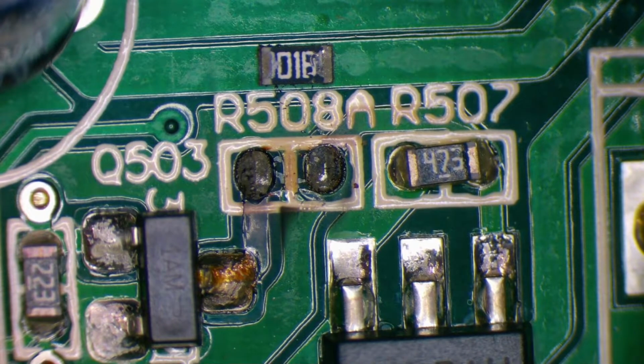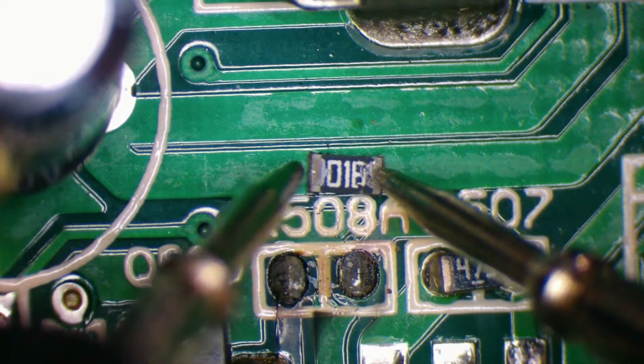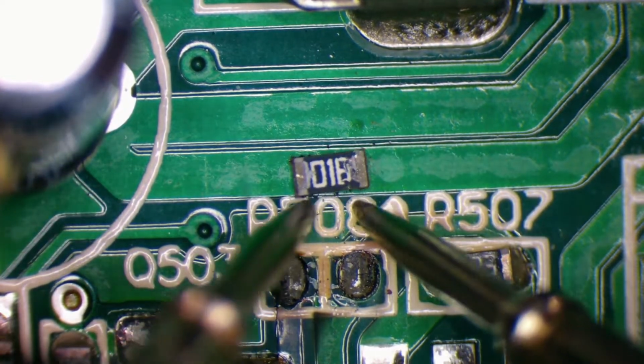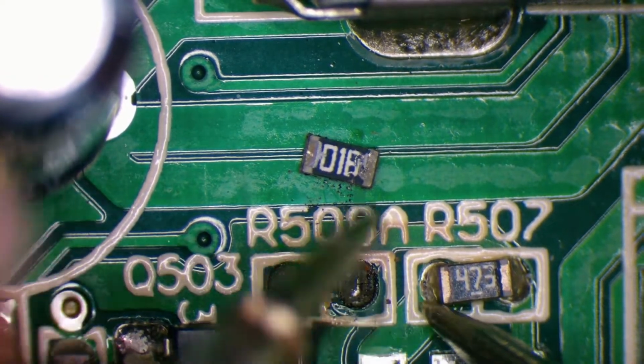01B is going to be, according to, let me find my sheet of information, 1K. Okay, it should be 1K ohm, according to a handy little website, kiloohm.info. They host a calculator, you can just put the code in. Survey says 1 kilo ohm. There we go. We shall reattach that and it'll probably work.